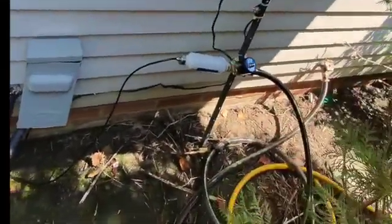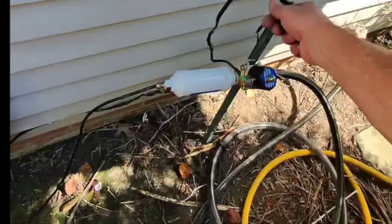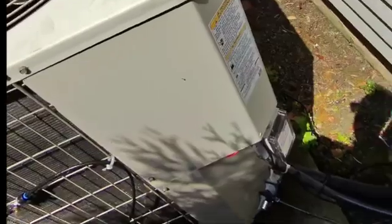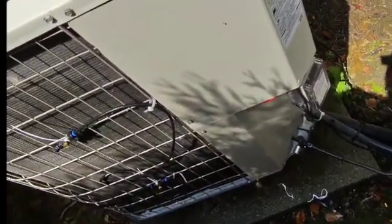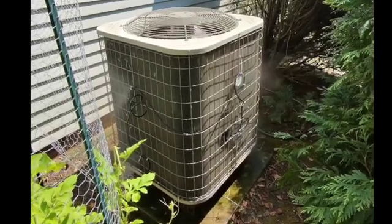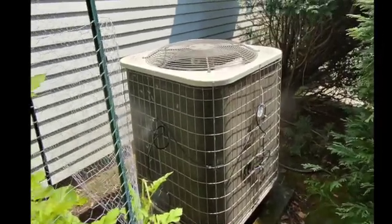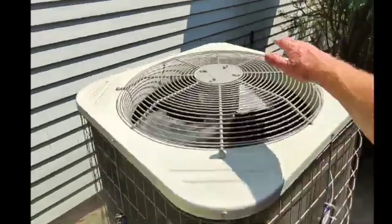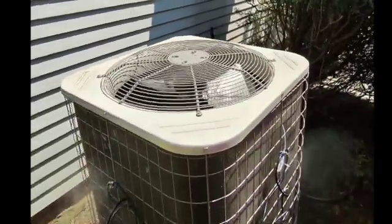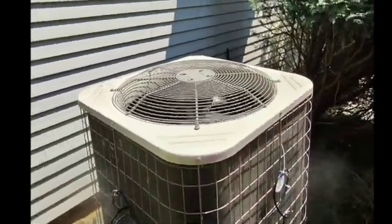Here we are back out at the unit. This is the setup — we've got the solenoid on there, our filter coming right off the solenoid and feeding the misting system. Here's our on/off switch. Because the thermostat isn't satisfied, it is sending a signal for the unit to be on, and when it's sending that signal, it also sends a signal to this solenoid. So let's move on to implementing some of the suggestions — the first one being measuring the temperature of the air coming out of the top. Let's go get our thermocouple and measure the temperature coming out of the top with the misting system on and with the misting system off to see if there's any difference.